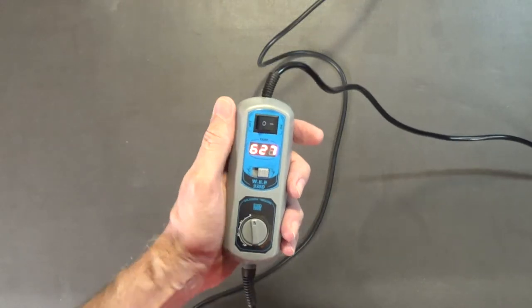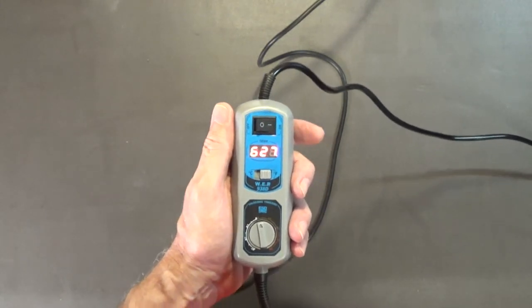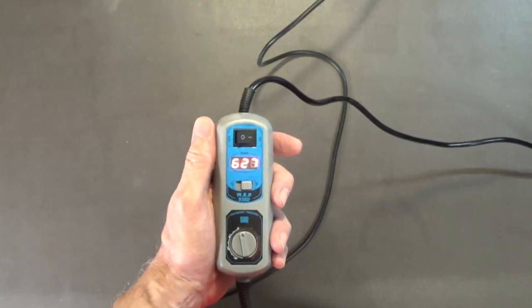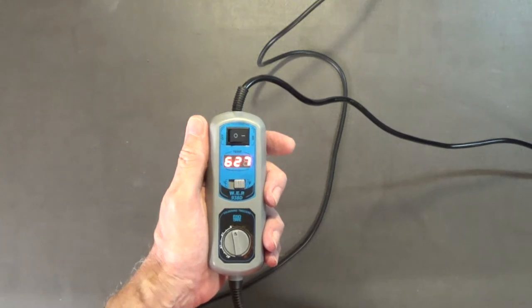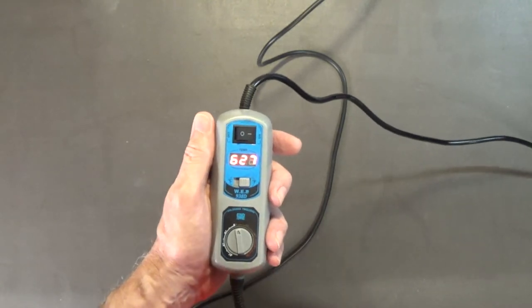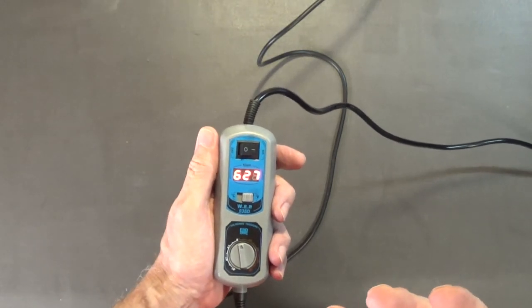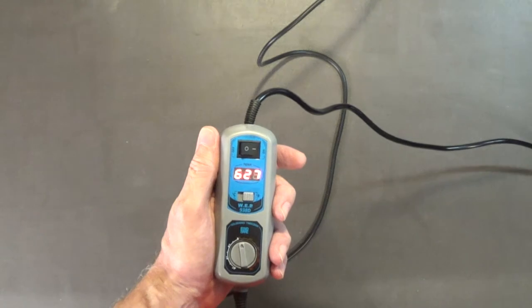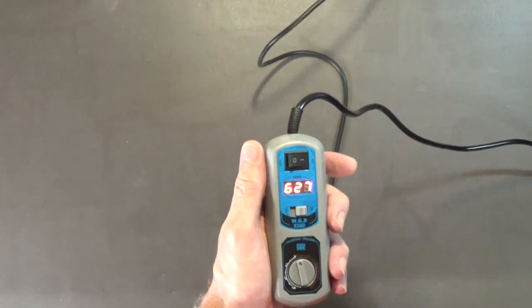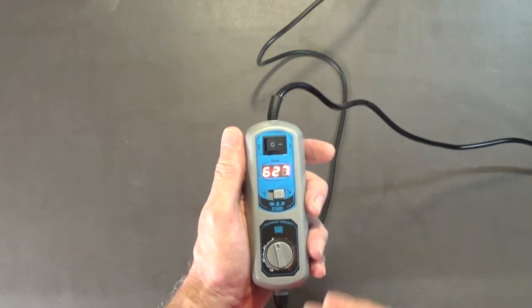Well, you're probably asking yourself, why do you have to raise the temperature up so high then, if your solder melts at 300 degrees Fahrenheit? Well, that's a good question. It has to do with how much metal the solder is adhering to and how much metal is around that solder connection. And so the extra temperature compensates for that extra metal. Okay, so the more metal you have, the higher the temperature. That's the reason why you need high temperature tips when you're dealing with large ground planes or voltage planes. You need a much higher temperature.